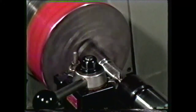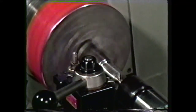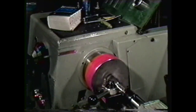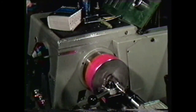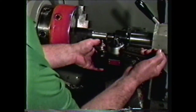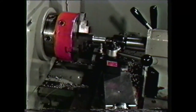Turn the diameter of the workpiece to the major diameter of the Acme thread, which is 1.250 to 1.240 inches. Tolerances for the major diameter of the Acme thread may be found in the Machinery's Handbook. After the major diameter has been turned, place the Acme tool bit in the tool holder. Swivel the compound 14.5 degrees to the right of center, which is one-half the 29-degree included angle.